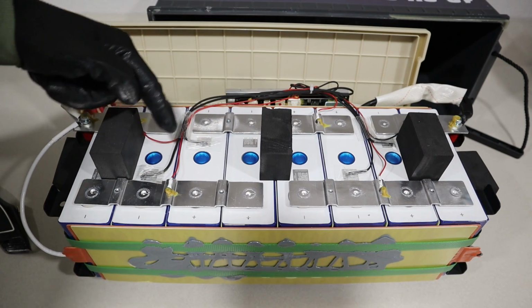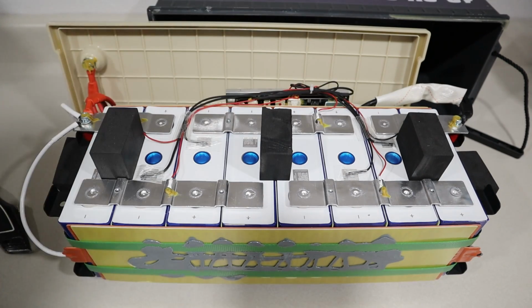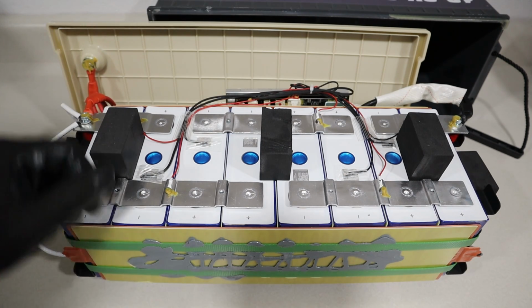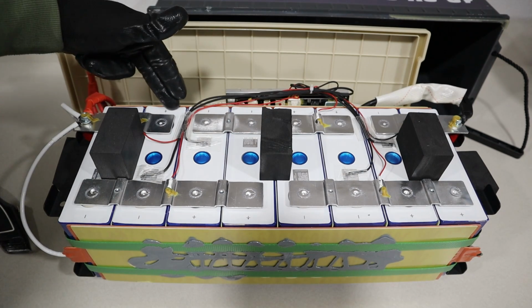And then you actually have 4 battery temperature sensors, so that will tell you when the battery is in a freezing state. Now, this battery does have heaters on it to keep it warm in the winter. You have a large heater on the bottom. This is the orange plate, and then you have a large heater on the top.